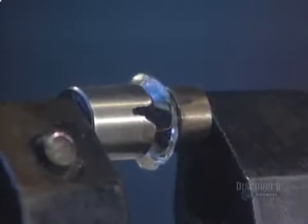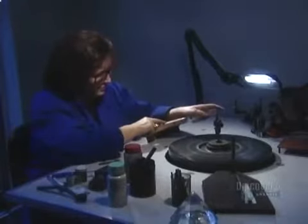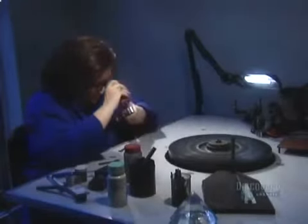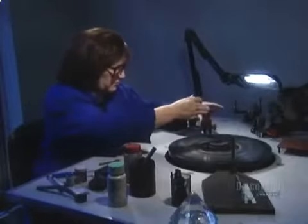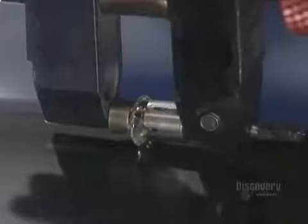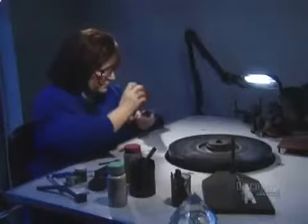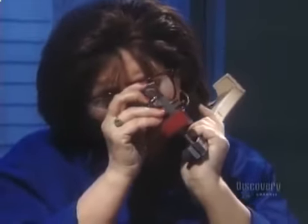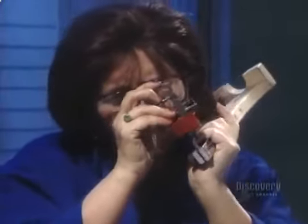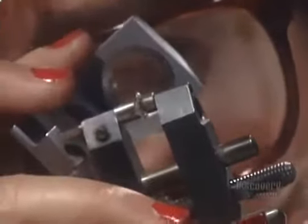Using another type of dop, the diamond cutter fashions what's called the girdle, the faceted rim that separates the crown facets around the top half of the diamond and the pavilion facets below. Diamonds are weighed using a measurement called carats. 1 carat weighs 0.2 grams. Polishing a 1 carat diamond can take 3 or 4 hours. When it's done, they boil it in acid to remove any debris.